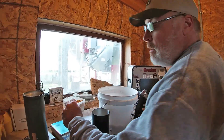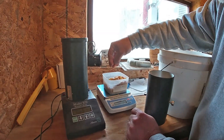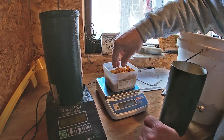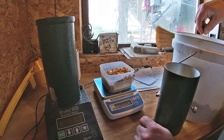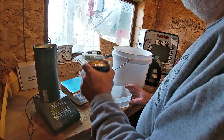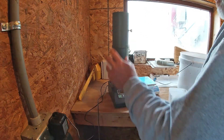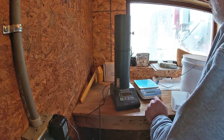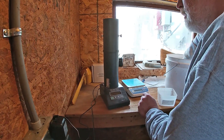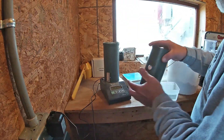So now what I do is dump it back in and put it on the scale — I need 250 grams. Keep putting it in until it gets to 250. Sometimes you're never perfect — 249.9, that's about as good as you're gonna get. You remind me of the guy at the deli when I ask for a pound. Pour it in, push test, wait for it to tell me to dump and load, push test again. That actually surprised me because I thought that corn felt fairly dry — 27.4%. My bite test was dry, though.